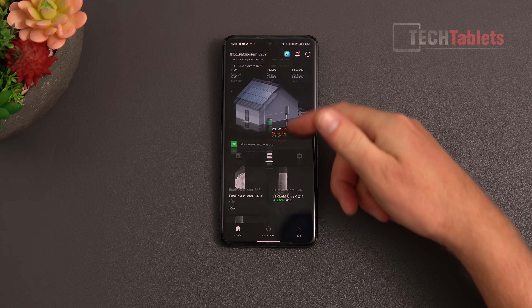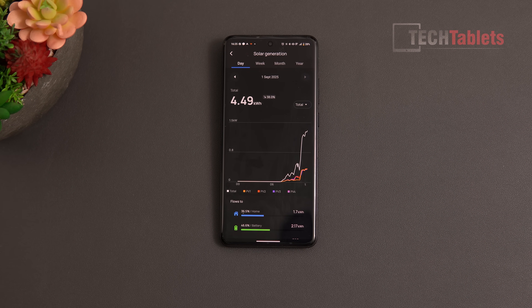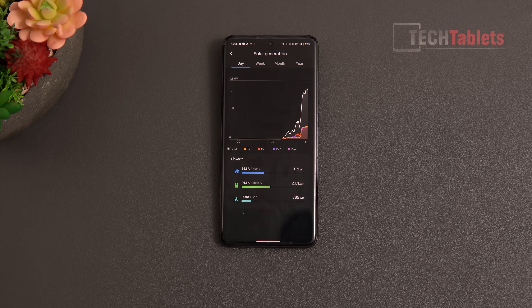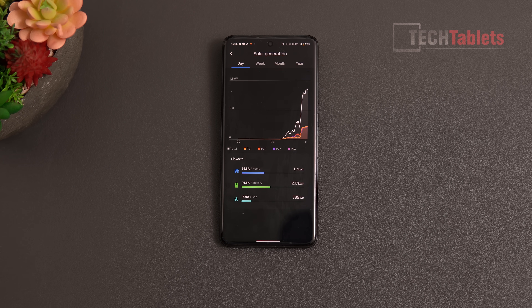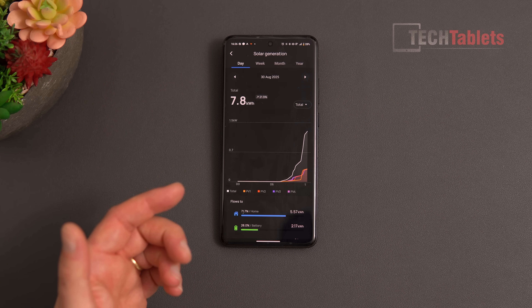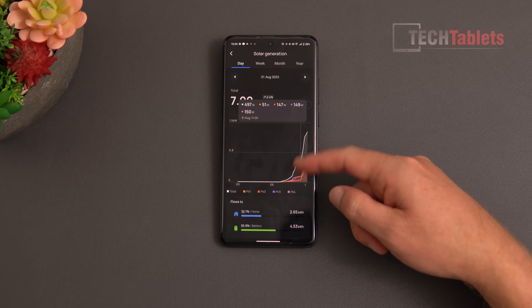Since the attic studio isn't where I live, consumption is quite low. Clicking the stats tab, today's generation is 4.4 kilowatt hours — slightly less because I unplugged some systems while filming. I've got a month's worth of stats. The energy flow covers the AC running in the house, battery charging, and a little back to the grid. On a good day — like the 30th and 31st — I saw close to 8 kilowatt hours of production. Heavy cloud or a storm will obviously reduce that.